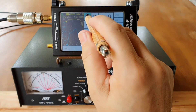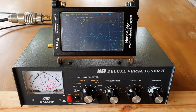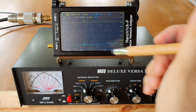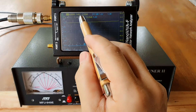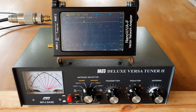The span is now from 7 to 7.3. My target frequency is 7.100. Over there it's 7100 and the SWR at this frequency is around 1.98, close to 2, as also shown here on the graph.